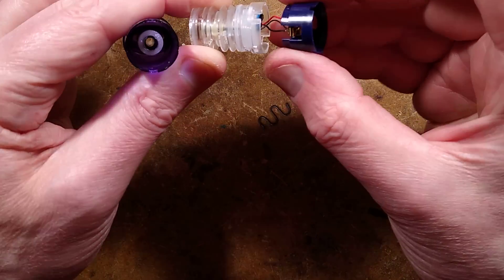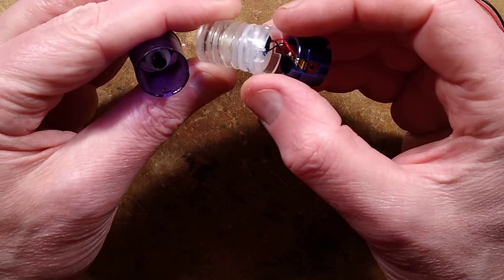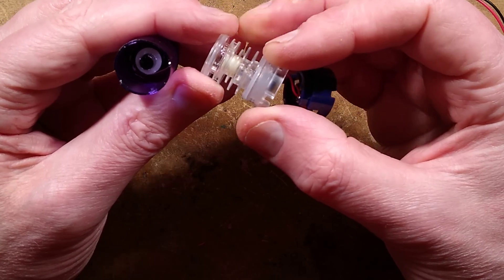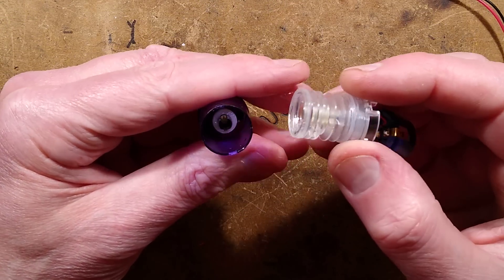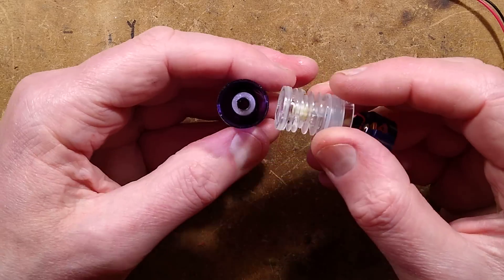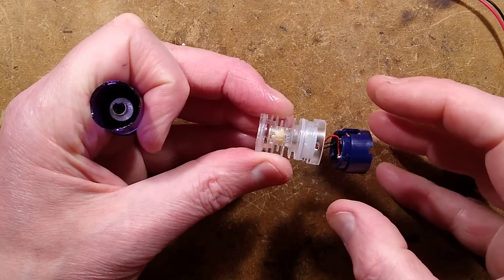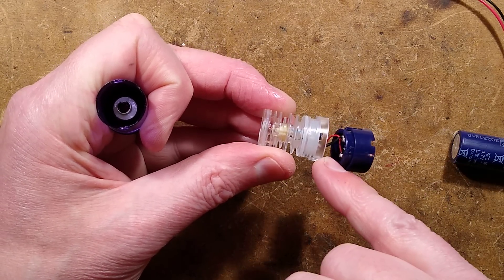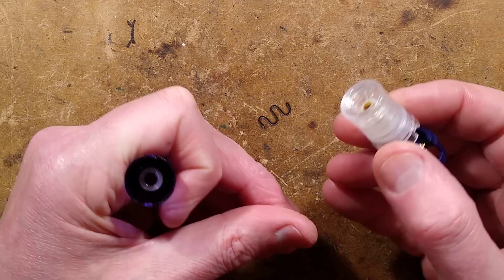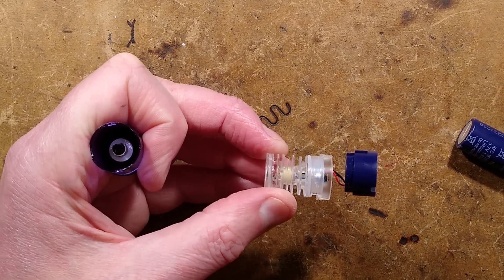On the subject of the rather attractive gold-plated contacts - the wires are soldered onto the standard little capsule device, then the heater, and this insert has an O-ring at the top plus these rings. It's quite nicely made, a smart little unit - a lot of engineering went into these. I ran it on a bench power supply and when I varied the voltage, it adjusted the current. It must be pulse-width modulating the current to the heater to match the voltage, keeping the power at around eight watts as voltage drops. That tiny capsule contains a lot of built-in intelligence.